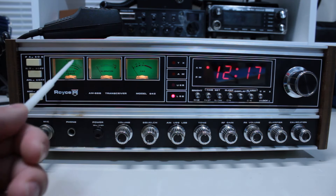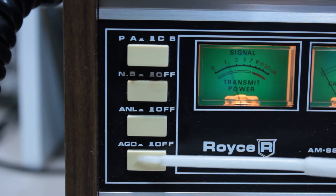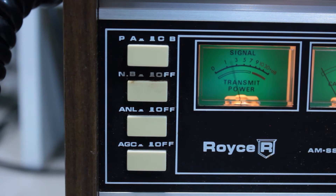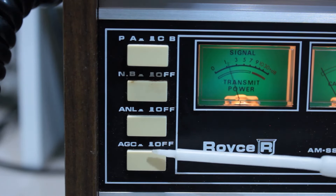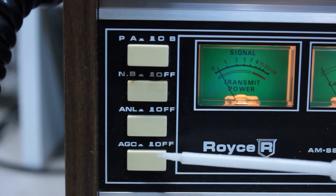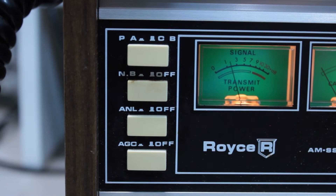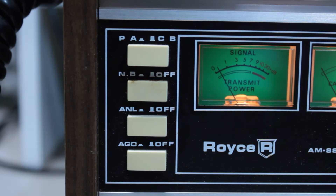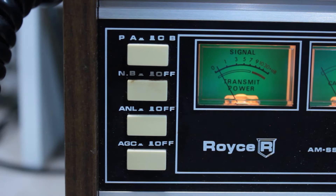However, this one had quite a few features on it. It's pretty compact, both width and height, and they packed a lot into the faceplate, which is really neat — especially 3 meters. This is really neat to have 3 meters on here. You've got your SRF and transmit power meter, a calibration and an SWR. These all work simultaneously while you're transmitting. The color on these is also really cool — at nighttime this thing looks really cool. Maybe I'll turn out the lights and show you as well. These green backlit meters have always been one of my favorites.